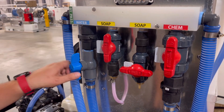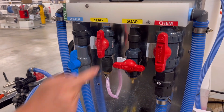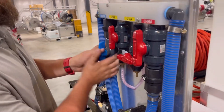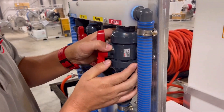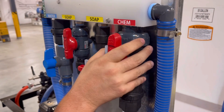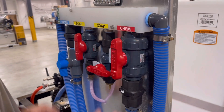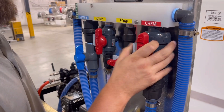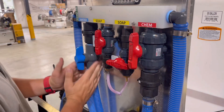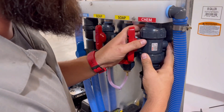And now he's got an air leak. The other problem I have with the execution — come over here — is even though this side didn't have the capability to bolt it down, this one did and nobody bolted it down. So this one has also got an air leak. I put my hand up here a second ago and I was just able to turn that — there's your problem. This one's really bad and this one's also bad. So he's got an air leak on two lines on basically a brand new system — here we were not using the correct thing, and here we didn't take the time to bolt it down.